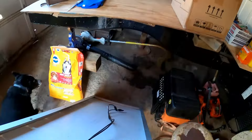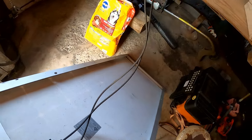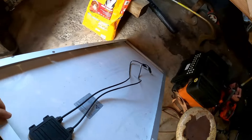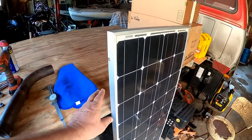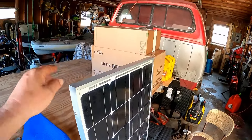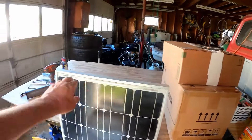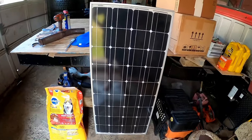I think the leads on the energy panel are only 18 or 24 inches, while these ones here are probably 36, so it might well reach. I need to do some measuring and buy a couple pieces of steel — not angle iron, I think just some flat stock, maybe inch and a quarter wide flats — to go up to either end of that rack. I'll utilize the existing holes, drill a hole in the steel, fold it to each side, those will extend out to the existing rack, plug it in, and it should be good to go.